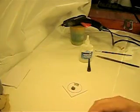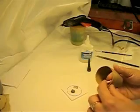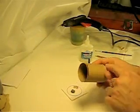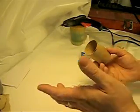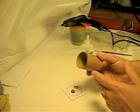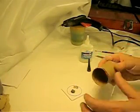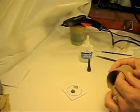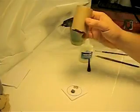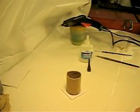The reason I made a circular shape is because I'm using a paper towel tube that I cut down with a scissor. You come across these if you're going to mold and cast. Keep your old paper towel tubes. If you get iced tea or lemonade, whatever, those cardboard containers are also good to keep because you never know. Instead of doing a box or cutting, you just go right over it like this, put a little glue on the outside, and you're ready to go.